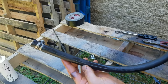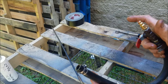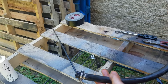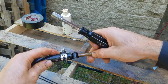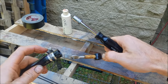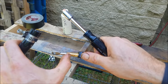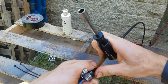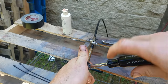Just to recap on safety: if you're using a hose that's not rated for high pressure, make sure to use a regulator and maybe only run 10 psi, or even use a bicycle pump so it won't hurt you if it blows. Definitely wear safety glasses. And you don't want the hose blowing off, so use the zip tie technique — a zip tie around the hose and around the fitting. Some cables have a barbed end, which will hold well, but since this is just a compression fitting it could blow off with 100 psi.